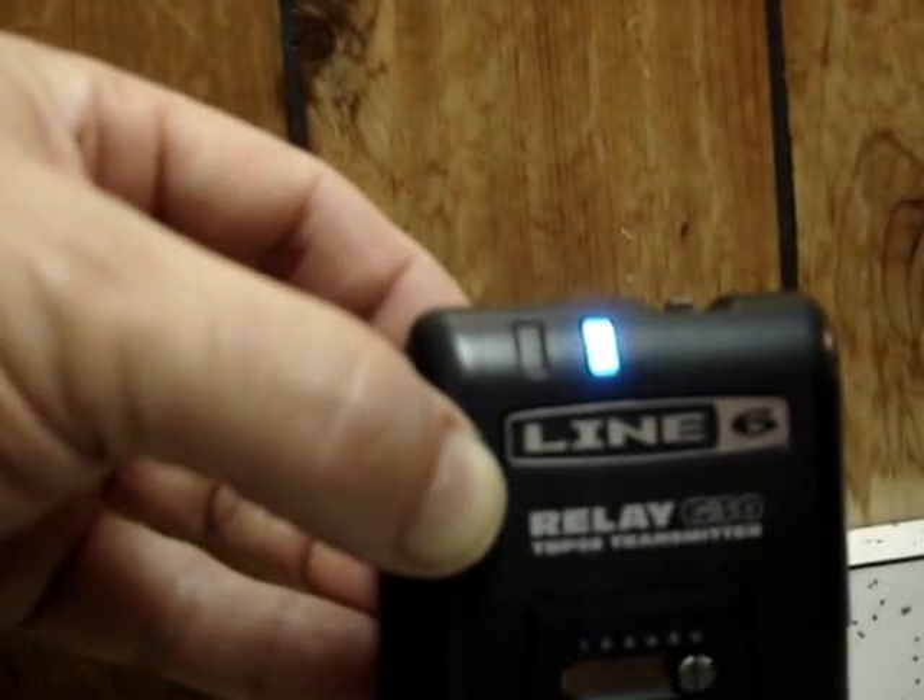So that's all you have to do to go from RF1 to RF2. Just start on channel 6 and go back and forth with the channel selector three times. Turn it off, then when you turn it on, you'll see the blinking blue light. One blink means RF1, two blinks means RF2.